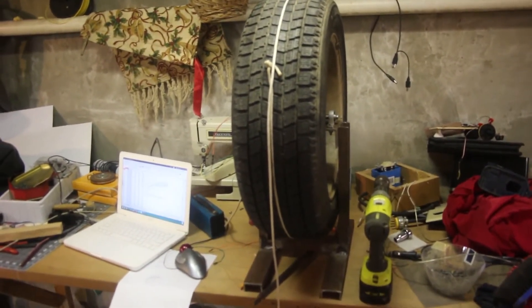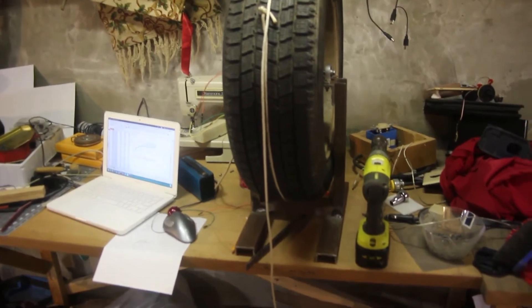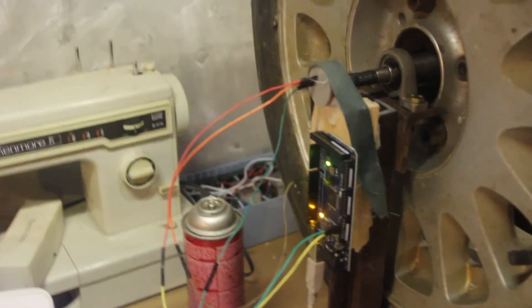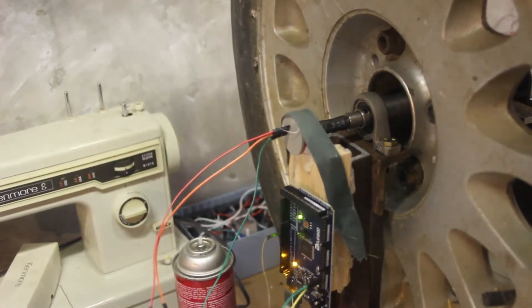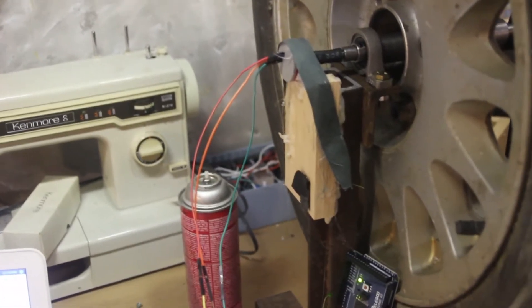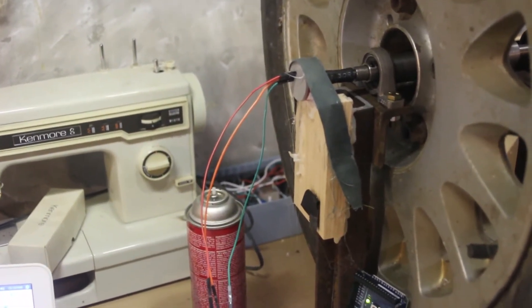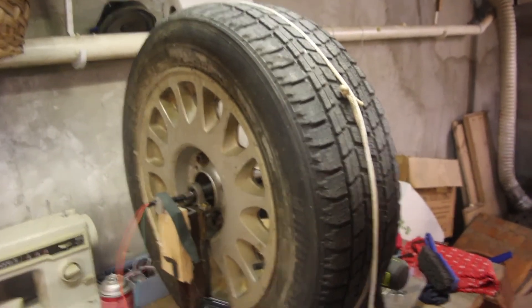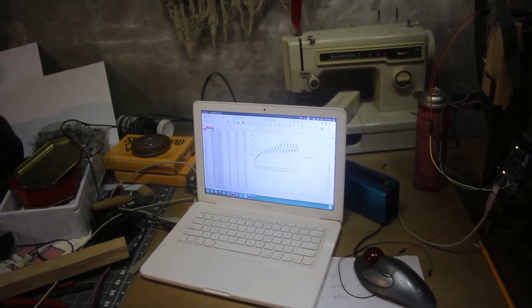We're going to try out the tool torque tester for the first time and get it calibrated. We've run it once but the encoder was wobbling too much, so now we've got the encoder hot glued on with fabric holding it on — look at that, that's professional right there. The hot glue got the electrical tape hot so it unstuck, so plan B, but we're ready to go. I've got a rope wrapped around; we're going to lift up 20 pounds of weight, drop it, and see how fast that accelerates the wheel. Then we'll log that onto the computer and see how fast the drill does it.